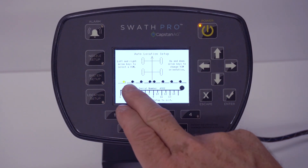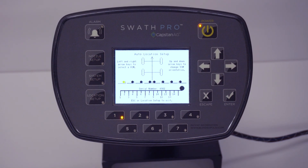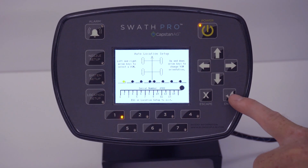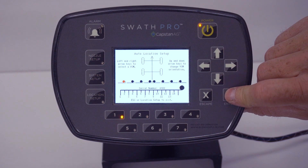As you can see, there are eight different VCMs across the screen. Right now we're on VCM number one and it's turned yellow. It is best to use a couple of people — one up in the cockpit and one on the ground going across and letting the person in the cockpit know what location each VCM is in. The one highlighted yellow: when you hit the Enter key it will pulse that VCM. You pulse it, it turns red, and you can hear those valves pulsing. Your person tells you it is actually in location one.